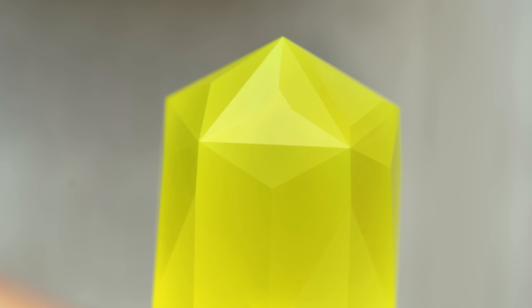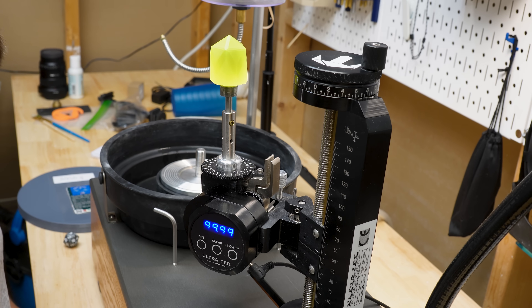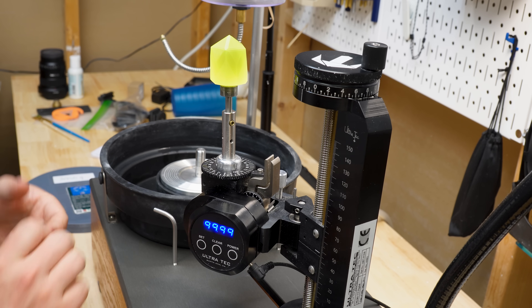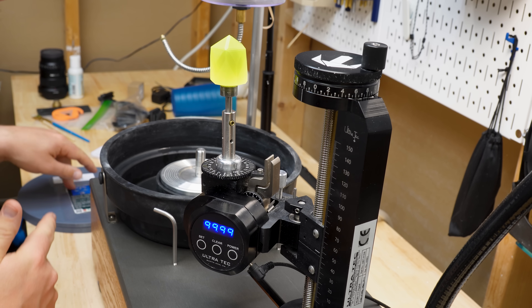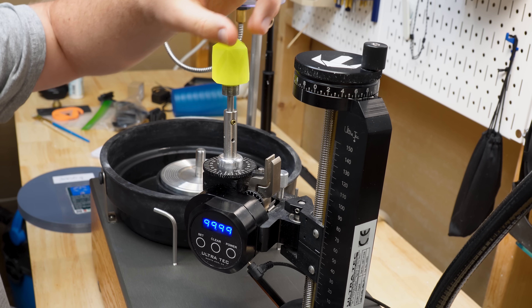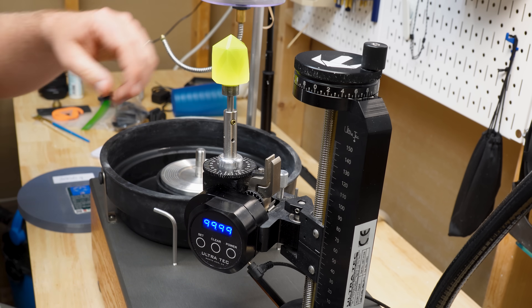This is all the way through 240 grit. Next will be 600 and we'll move on from there — this is probably 99% of the material that needs to be removed. We have this thing entirely cut into 600 grit and it looks fantastic. Kai came over and we were calling an audible in terms of frosting some of these edges. Right now it's time to move on to polishing. I'm going to do 3000 on zinc lap, and this stage will take a pretty long time — you have to do a really good job on the 3000 before you move on or else it takes even longer.